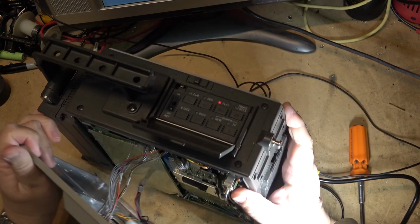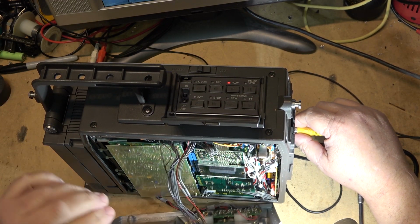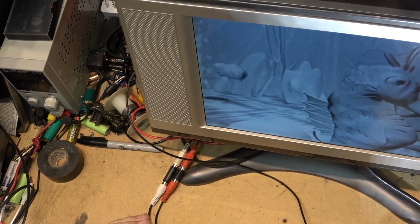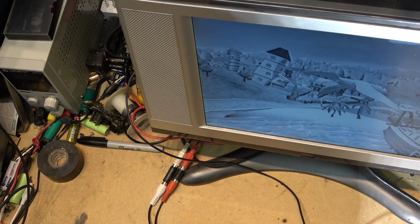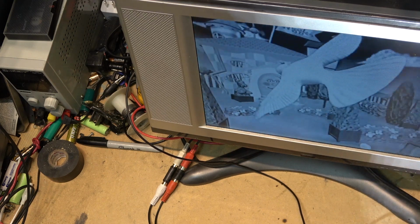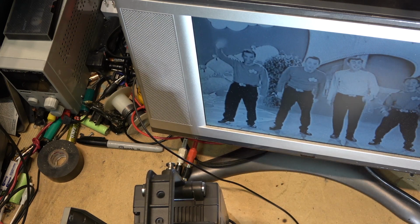Oh, what do you know? It finally locked in. Not in color, it locked in black and white. There's no color. It says PAL on my monitor, but as you can see, there's no color. And my TV is detecting it as a PAL signal. If I disconnect, you'll see it'll say PAL. And no color. And of course now it has audio for hi-fi, nothing for normal. I'm only getting one channel on here too. And one channel, only putting out sound off one channel.